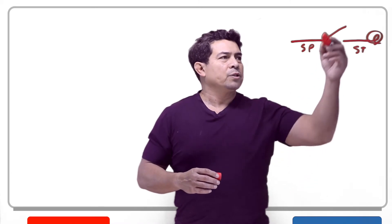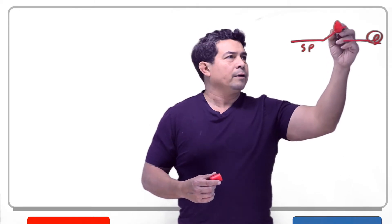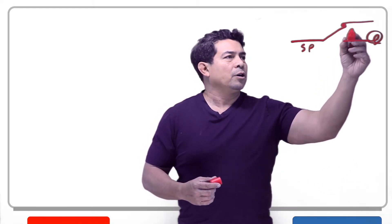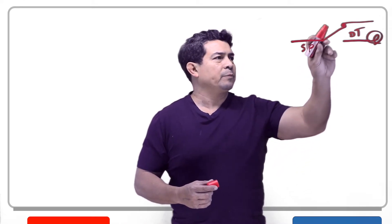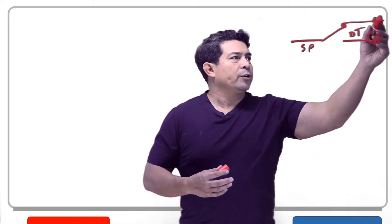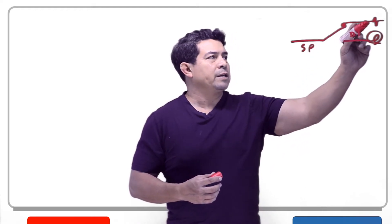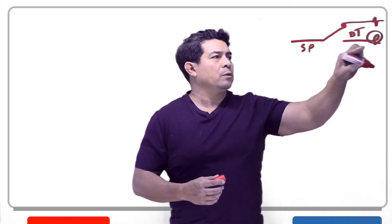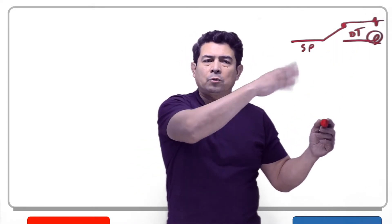Sometimes what you see is a switch that is what they call a double throw — single pole double throw. What happens now is that we flip the switch down and we can turn this light bulb on and off. We can also go ahead and turn another load on and off with this switch. So now this has power going to it and we're running this coil. When we come down this way, we can turn this light on and de-energize that coil. So we can control two different loads.